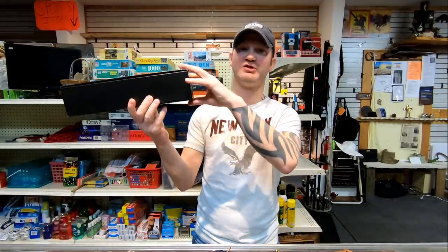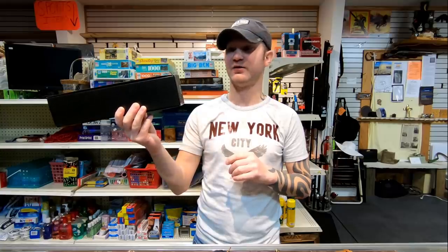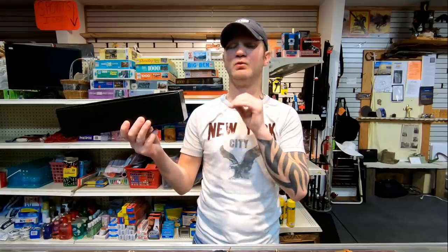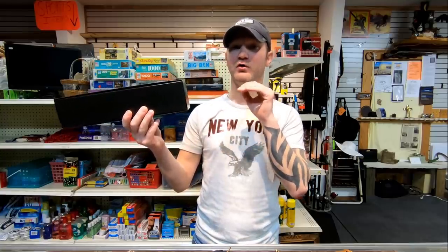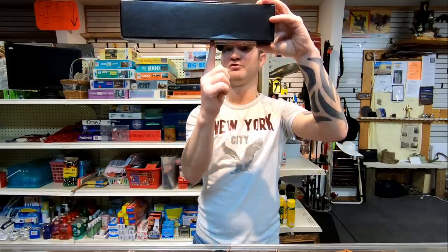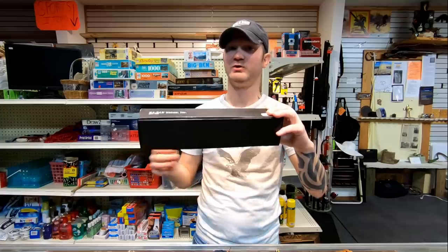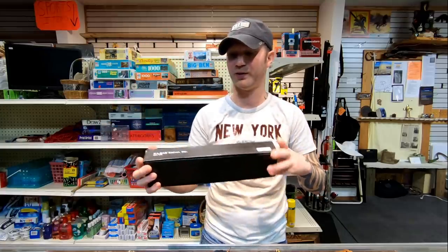Now, an I-beam of this same shape will have similar strength. It'll have less strength, but it will be similar. Because the only surfaces that matter are the top surface and the bottom surface. This will be compressed, this will be stretched. Once they start to break, it doesn't matter how thick of a piece of metal you've got, the break continues all the way through it.